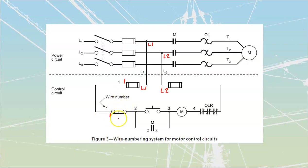Here we hit a device, so we have to change numbers onto the other side. Now we go to this side and start with a two. I trace along this line and label every terminal with a two. They only show a couple of twos, but it's far easier if you place them up against every terminal. Be aware that you're going to have numbers like 13, 14, 21, 22, 95, 96 — those are all common terminal designations on the devices. What we're doing right now is making up wire numbers — these are for the little wire wraps you place around wires for labeling. The actual terminal numbers in this case would be 13 and 14 off these contacts, and terminals 95 and 96 off the overloads. We'll put those in later.